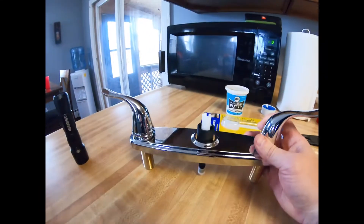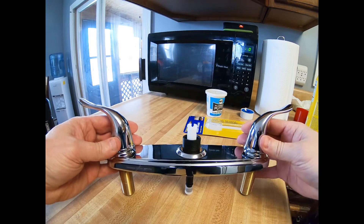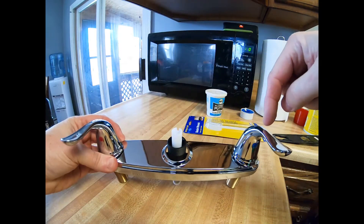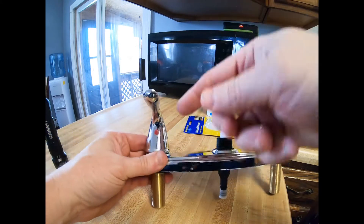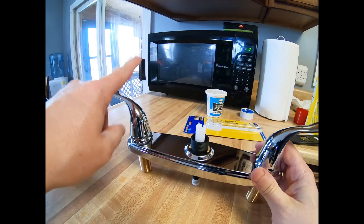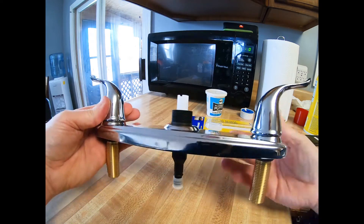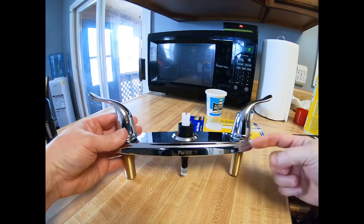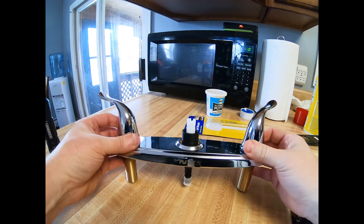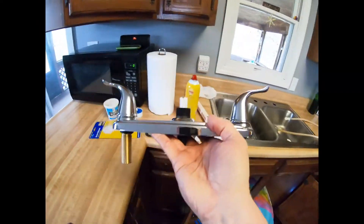Something to remember: these knobs — you don't want to put this thing on backwards. These knobs turn out like this. They don't always say hot or cold — sometimes it says H or C, this one has a red dot and a blue dot. But you want to make sure you put it on with hot on the left and cold on the right. If you put it in backwards, the valves won't open right and will hit the wall. Make sure you identify the front and back of the faucet.